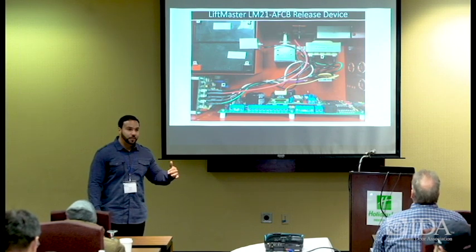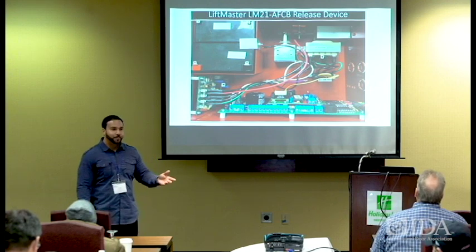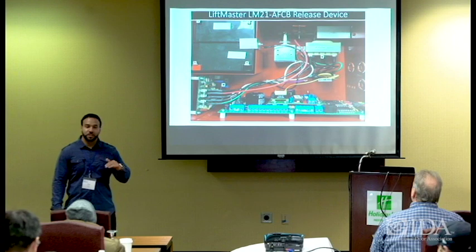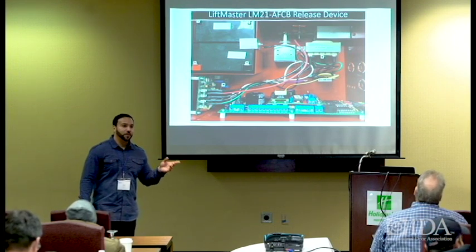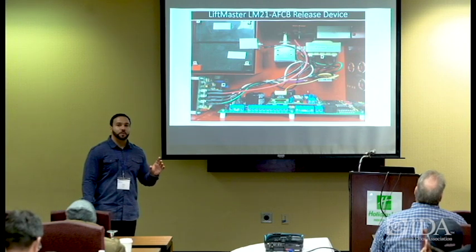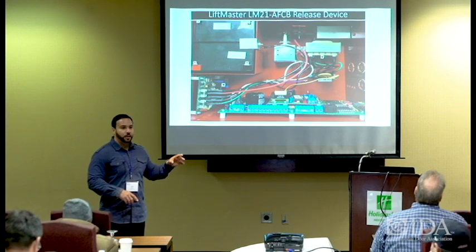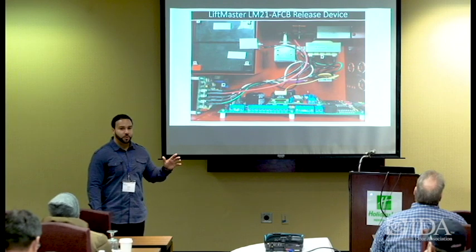If it's 460, it's so powerful and the amps are so low, it throws you across the room. Now, you're still probably dead, but you didn't get stuck on the circuit. So that's the key right there. So voltage and amps, understanding them and knowing what they mean. Amps take your life. Volts, you want to understand them, but you don't want to play with them, but that's what you're dealing with. So anytime we're dealing with this, it's about life safety. This is electrical equipment. This is a circuit that puts out power and takes in power. You want to be aware of that as a technician.